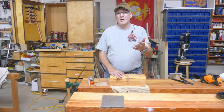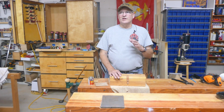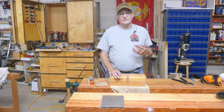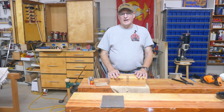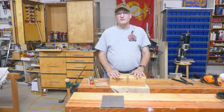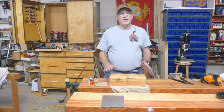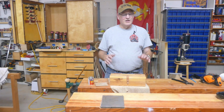Matter of fact, a Warrington hammer, I'll try and find one of those. Those are pretty cool hammers. Usually you can find them at, I hate to say an antique, but an antique mall or fair. But I wouldn't pay too much for the things, $10, $12, because quite frankly, they're really not worth much more than that. It's a hammer. But it's kind of a cool hammer if you're doing kind of tack work and those kind of things. Works out really well for small nails. It keeps you from beating your fingers to death. I love those things. Same with the planishing hammer. It's one of those things you don't need very often, but when you do, they come in handy, like any tool.